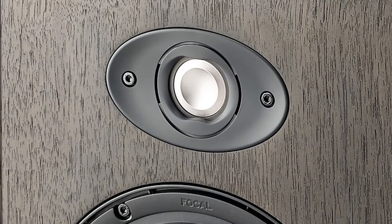First, the M-reverse dome tweeter, which adds more rigidity and has a smaller voice coil which is easier to control. The reverse dome itself gives you a wider sweet spot in general. The waveguide around the tweeter hides the tweeter from the cabinet, so there are fewer anomalies.